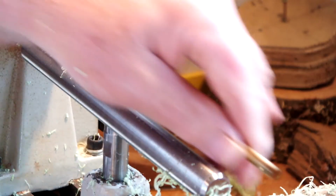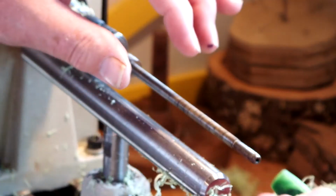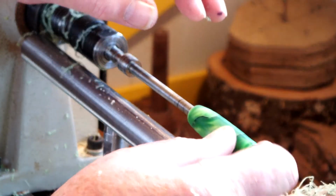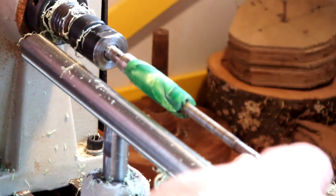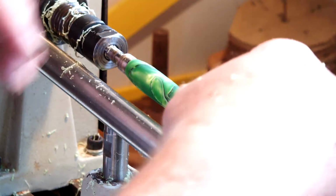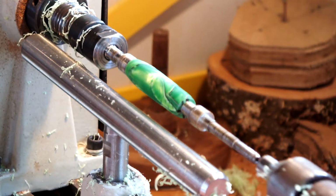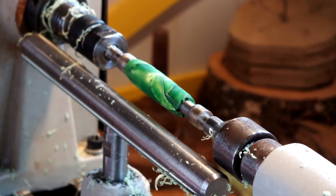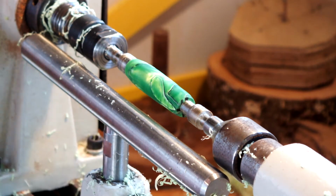You'll notice that I slide a 7mm tube, the standard 7mm tube, inside the slightly larger one. That keeps everything centred on the mandrel and keeps everything tidy. A little bit more and we can polish this up, and then we'll have our unit done.